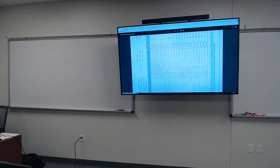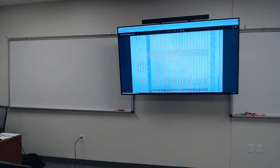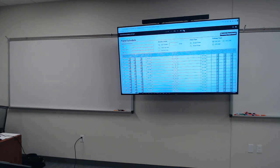This right here is your panel schedule. Okay, let me see if I can rotate this here. Okay, this right here is your panel schedule. A panel schedule, gentlemen, is basically saying what breaker serves what inside your home, right? Every electrical circuit, you got a 20 amp circuit breaker for the master bedroom, you have a 30 amp circuit breaker for your dryer, you have a 50 or 40 amp circuit breaker for your AC unit, and you put in the description what it serves.